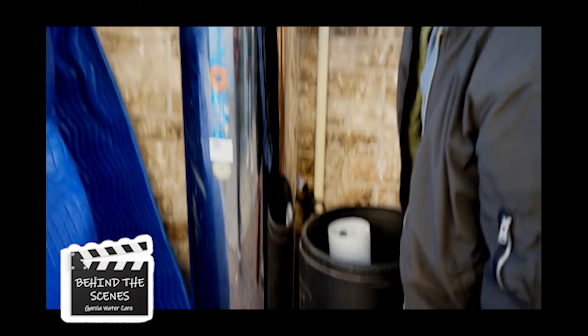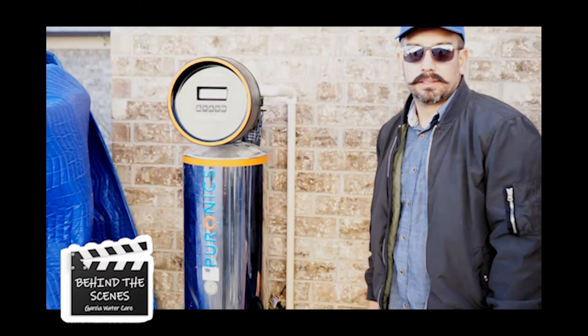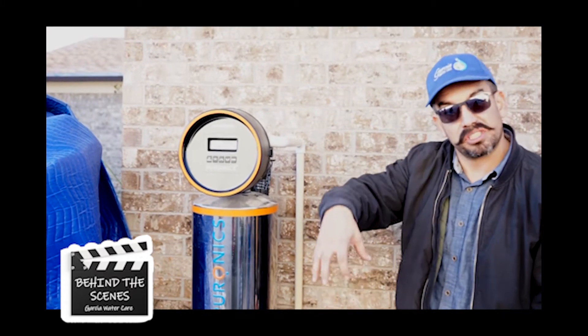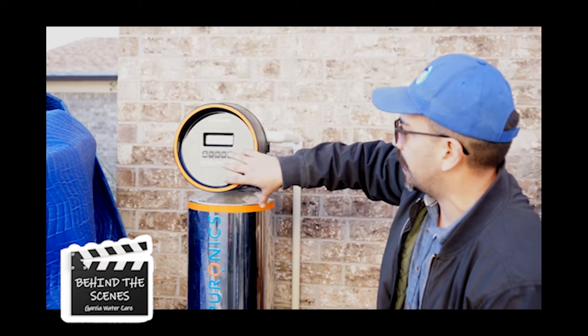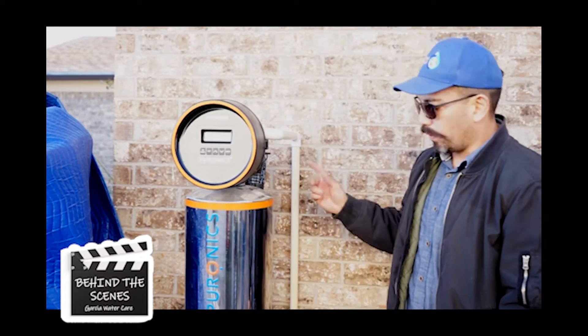We'll go to the next stage. For 120 minutes — two hours — it just hangs up, soaking up as much salt as it can into the water. After those two hours, getting as much brine liquid and sodium ions as possible, it then does an eight-minute backwash.